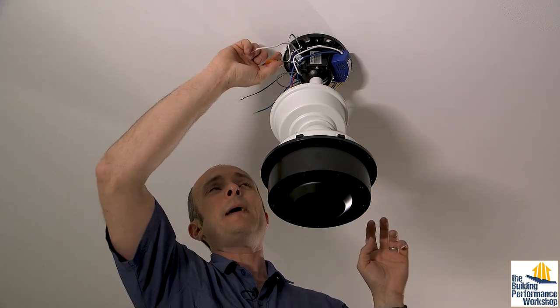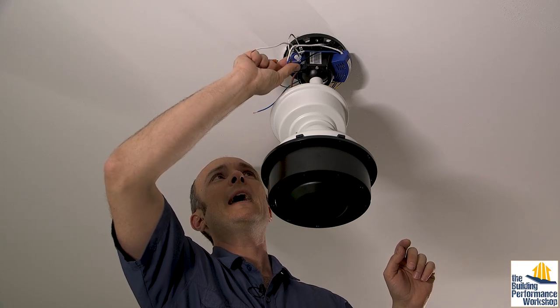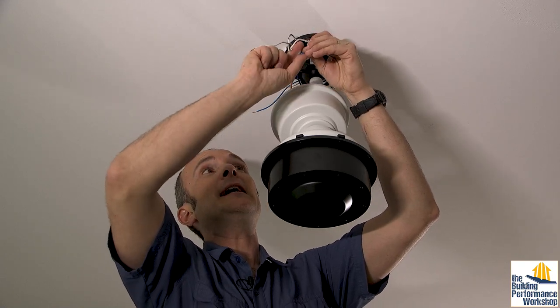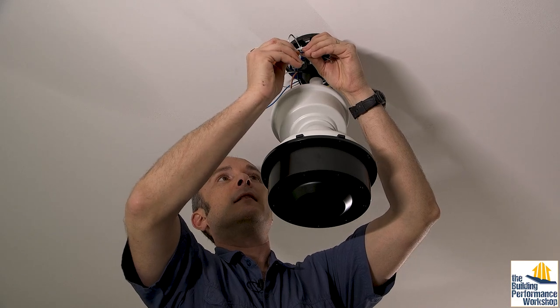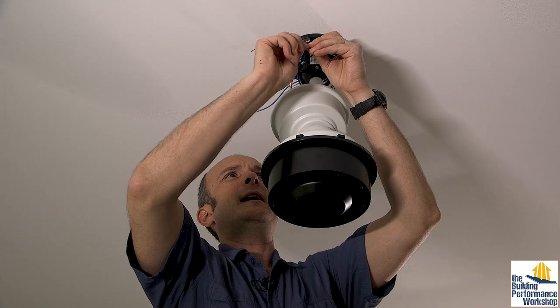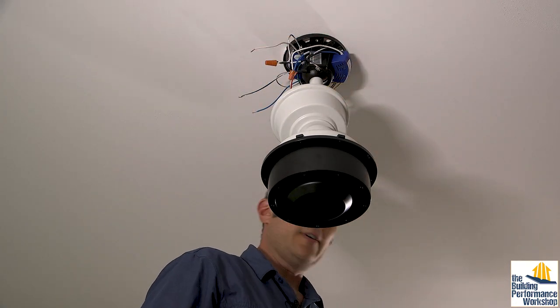The fan has power. There are two wires here — blue and black with white stripe — that say 'for light.' If you do not have a light, you need to cap over these on their own. That might not have been made perfectly clear in reading the instructions.